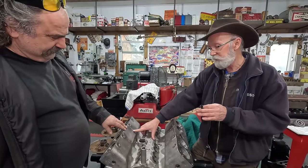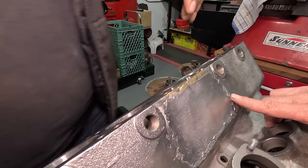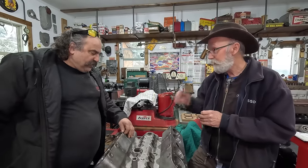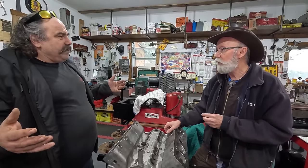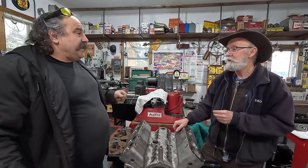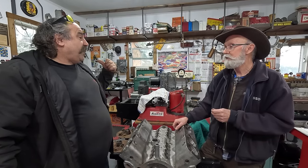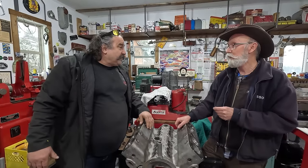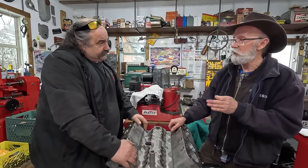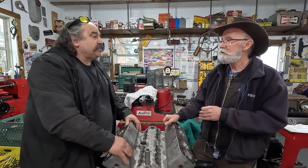I'm almost tempted to weld it, but I didn't realize till later that this block has a lot of nickel in it. The more nickel, the easier it is to weld on. Back in the day when I used to work on boats, the exhaust flaps on the back would break and suck water — you'd hit the starter and it would blow. If you got lucky and it just blew the starter off the mount, you'd go in there with some Ni-Rod and weld it. But back to this stitching — stitching is a cold process, so you don't have to worry about that heat problem with cast iron.